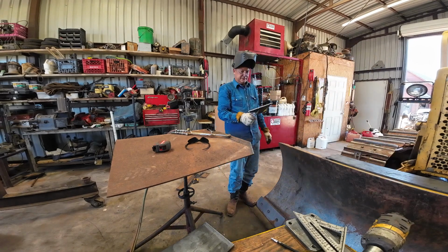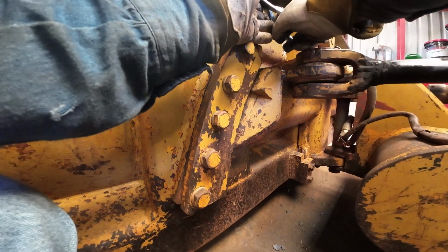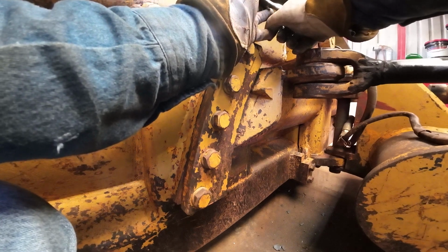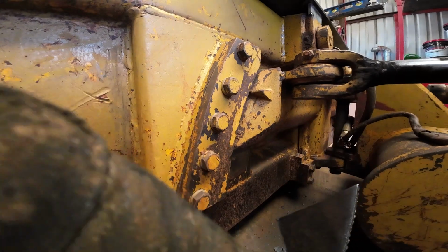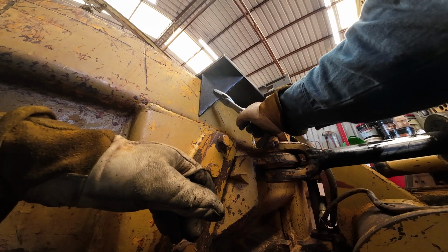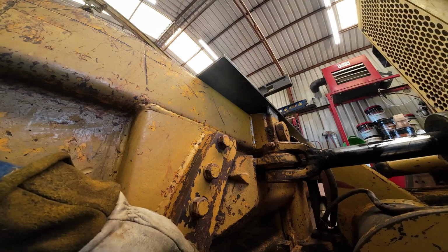What I wanted to do is make a gusset. Just kind of mock one up. They're not quite a triangle. But I just kind of wanted to see what it would look like if I put the 45 on there. I don't think that'd look too bad. Or I could put a 22 and a half on there. Have a little different size gusset, but I think I'd be happy with. So it would set like that right there. After I cut that top off, I'll set it in there where it needs to go to get it flushed up, and I think it'll work. So I need to lop these off.